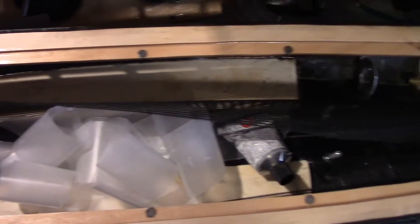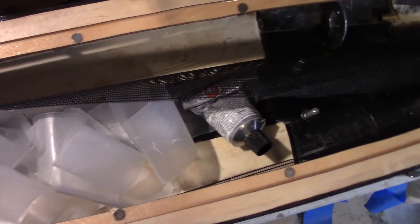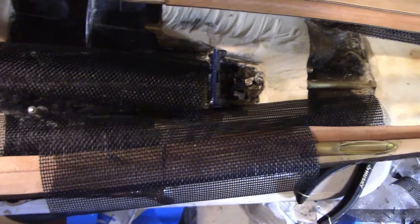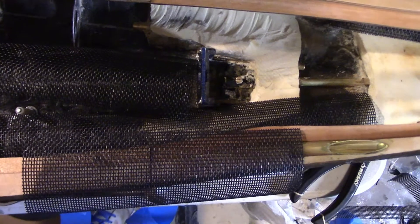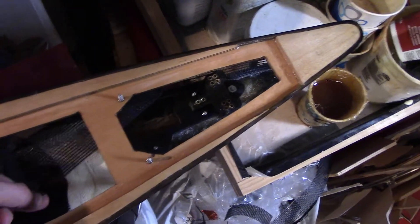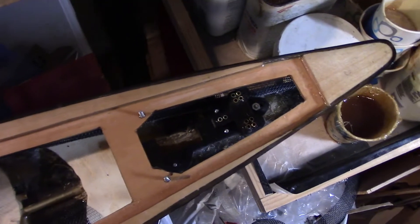At this point I have the pieces cut for most of the boat, so now I'm ready to glue it in. I'll cut out some strips of wax paper, which are going to help prevent the clamps from sticking to the glue. I'll use goop as my adhesive and have my clamps staged. I'll start at one end — in this case the stern — and then piece by piece I'll take the piece out and put gobs of goop on it every few inches apart. This small piece I'll probably do about three: one each end, one in the middle. I'll feather in with the stern piece — that'll probably be the most difficult because when you're sliding it in with goop on it, you can easily get the goop on other parts of the subdeck, which is not a big deal, just kind of annoying.